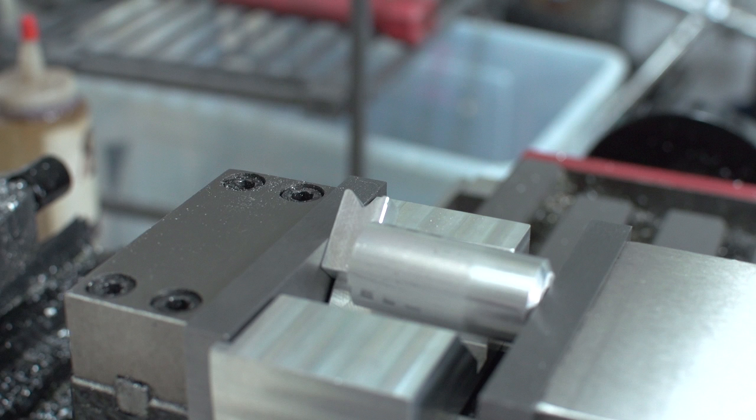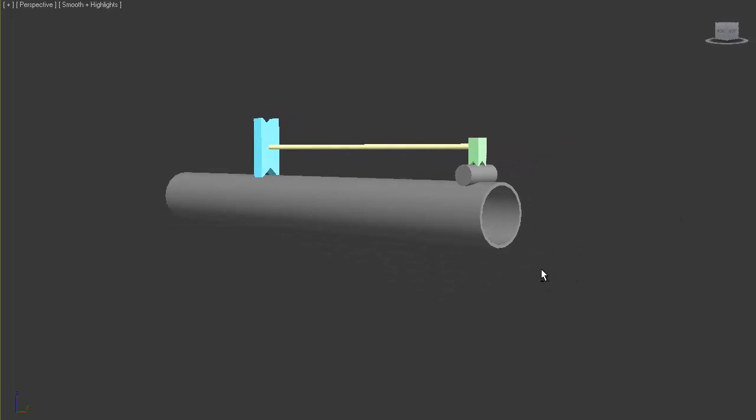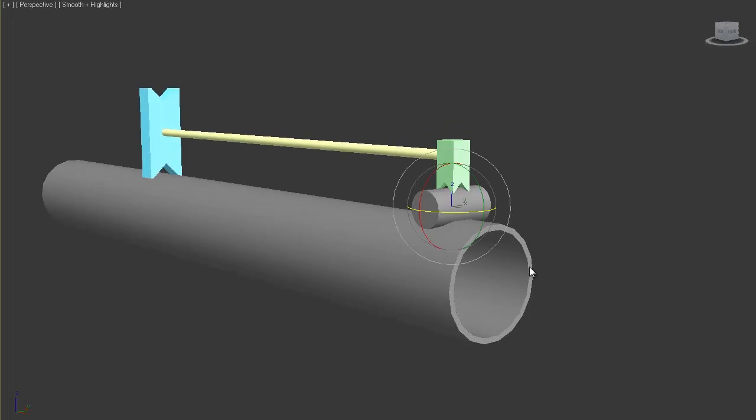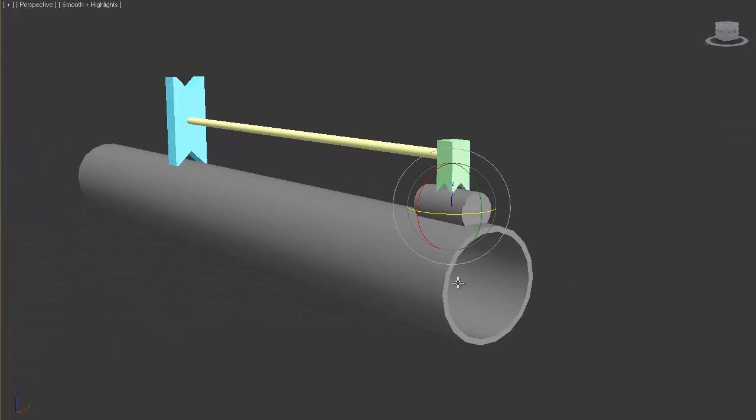Alright, so I was going to make the tool so that I could flip it, but I changed the plan to a simpler design. Instead, I'll cut a horizontal and vertical V, both on the same side. This allows the holder to secure horizontal or vertically placed bosses.